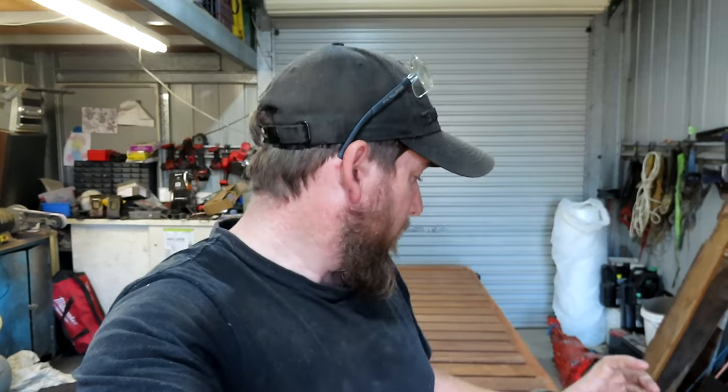I'm used to working with steel, and if you buy a piece of steel and it's 20 mil, it's 20 mil. If you buy it, it's 25, it's 25. If it's inch, it's 25.4. I assumed, which is definitely something I shouldn't have done on my part, that these planks were 90 mil. They're not 90 mil, they're 89.7. Every one of them, they vary about 0.1, so they're pretty accurate that way, but I didn't measure them.